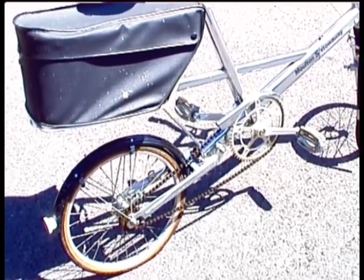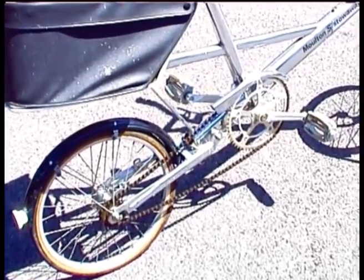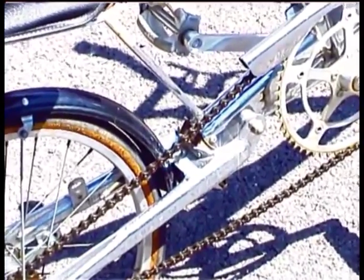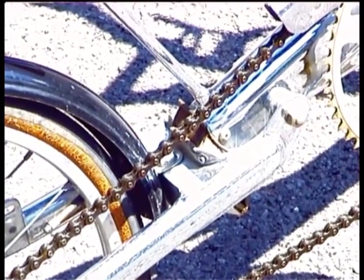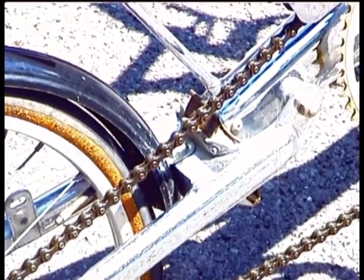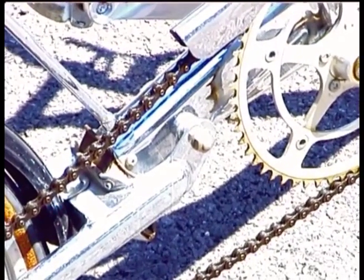While we're looking at this Stowaway here, we'll just zoom in on the rear suspension a little bit, because of course one of the differences between the early prototypes and the production versions was that the rear suspension element, the rubber, is not just in direct compression, it's in shear and compression at the same time, because it's got a radius to it. You can probably just see a slight curve, but that's offset from the radius of swing of the rear arm. You see the pivot bolt in the centre of the picture now.